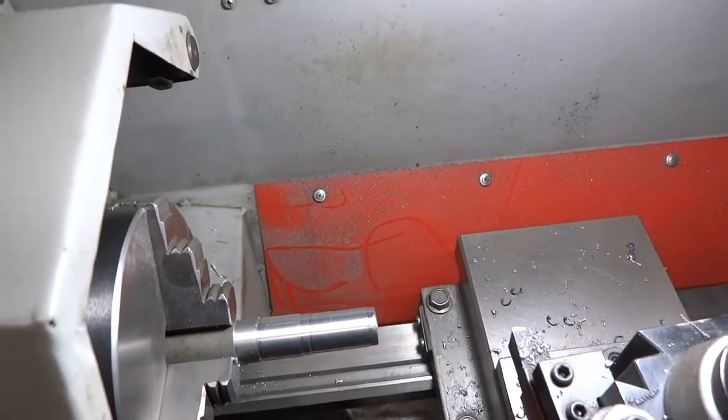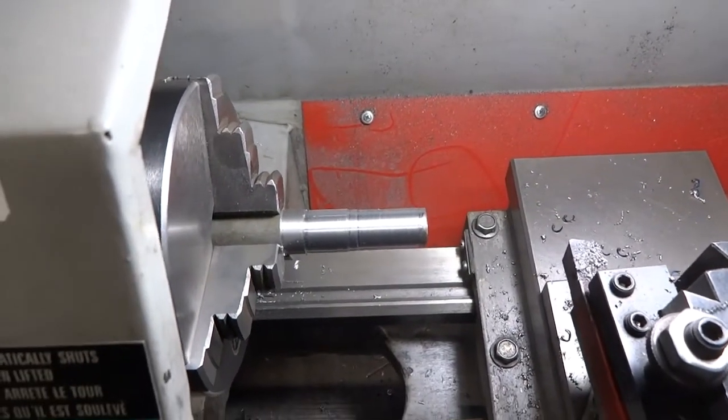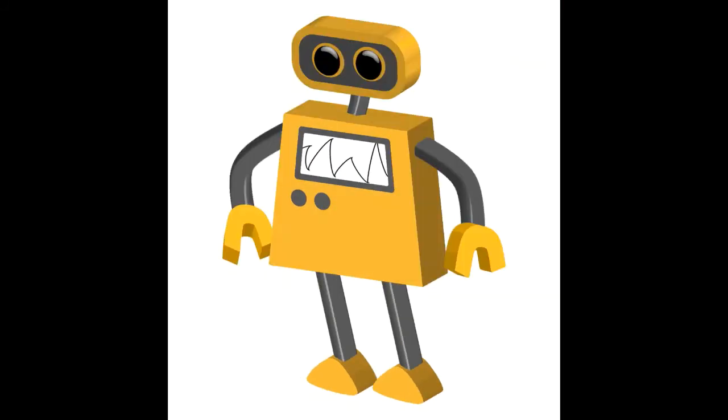So there's your springback for you. If we were to check that again now, it's going to be very close to .635, because as you can see, it was taking more material off without making any adjustment to the cross slide setting — and that's springback. After replacing that two-hole plate with the three-hole plate, we're still looking at about 2 thou springback after a 20 thou cut. That was worse with the plate that only had the two holes — almost twice as bad. So changing that plate can improve the springback. And if you don't change the plate, at least be aware that this is what's going to happen, or you'll end up with smaller parts than what you thought you were producing. If you'd like to be notified of other new modifications, please click on the subscribe button. Thanks for watching.